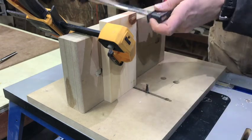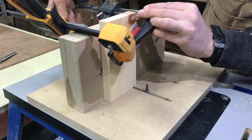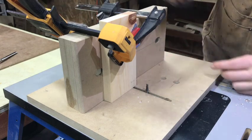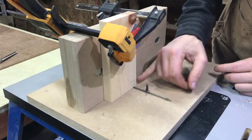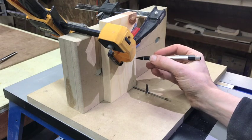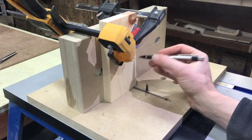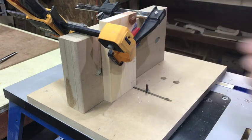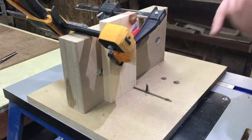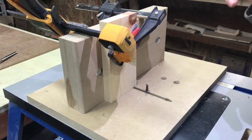So we've got this clamped down, and we are going to want the top over near the pin, since we want this to be over. This is our over piece. And it doesn't hurt to label with an O and a U as well, so that you remember when you go to this side. For a bit like this, I generally have it on the highest speed setting, though you can toy around with the highest and the second highest if you want.